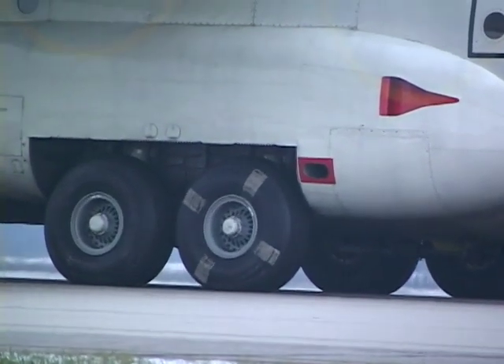The carbon-carbon brakes did, however, improve braking distances at heavier operating weights, where tires had greater traction and anti-skid performance was not the dominant factor. The improved brake performance, with greater energy capacity and improved thermal performance, will provide the C-130 fleet with greater flexibility for mission planning and execution, as well as providing a greater margin of safety. The carbon-carbon brake installation is 260 pounds lighter than the steel brake configuration and provides over 1,000 aircraft-brake landings before requiring a brake change. The tested brakes and wheels showed no faults during the hard braking tests conducted. The Snow Aviation General Atomics demonstration testing of the Messier-Bugatti carbon-carbon brakes clearly shows many advantages over the current C-130 steel brakes.